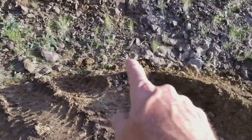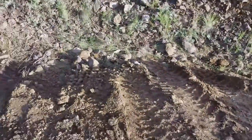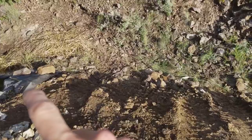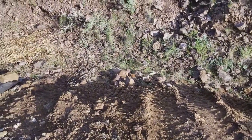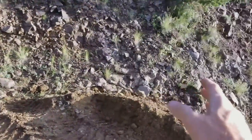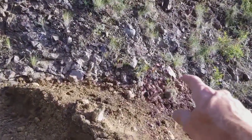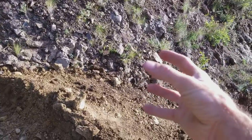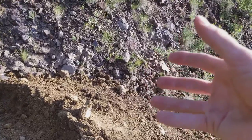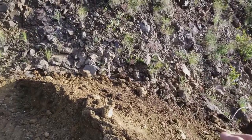I didn't fill in over here where this dip is — you can see the shadow shows the dip, and it goes from there and comes around to here. What I'm going to do is bring over the concrete I have at the house, lay a weathered 2x4 along the dirt, pour the concrete all the way out, and take a trowel to shape it down into a V for better flow. Then at the end I'm going to set a piece of 4-inch PVC pipe into the concrete.